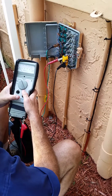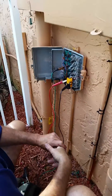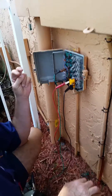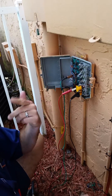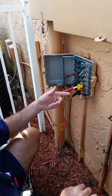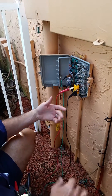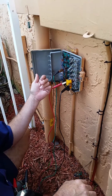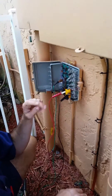That's what's going on — there's cross voltage. In this situation, what you're looking for is a two-line jack where either the pins have been damaged or there's corrosion across all four pins. The corrosion is metallic and it's going to cause them to conduct to each other. So voltage from 3507 is going onto 3505 and vice versa, killing each other — because you can't have that much voltage on a line.